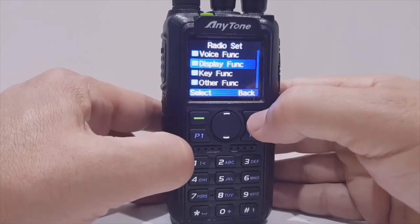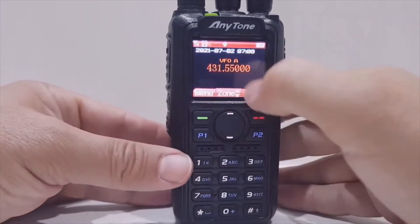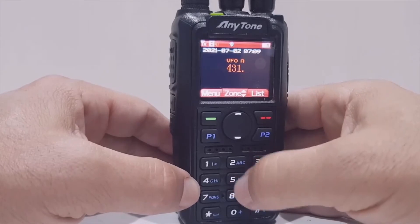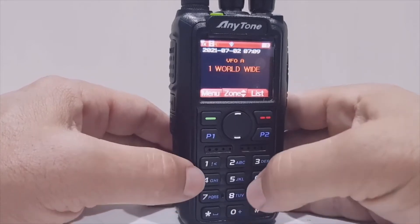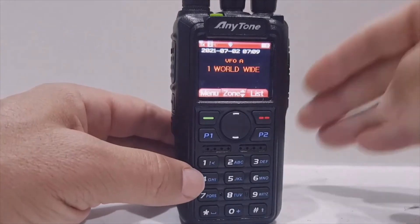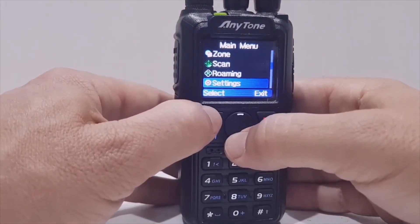So we're in memory mode — we want to get into VFO mode to program a new channel. VFO mode is this button. My hotspot frequency is 431 — it says something else worldwide but ignore that — my hotspot is 431, then the last five digits: 55550. Keep going until you've got five digits. In a second it will show that frequency — there we go, so now we've got the frequency in there.